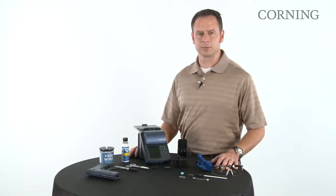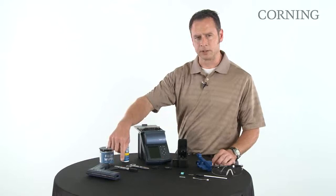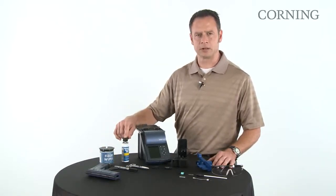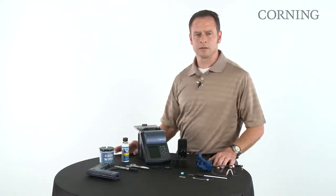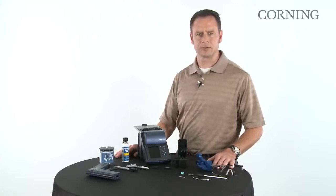The tools needed for this procedure are the cable prep tool, black marking pen, lint-free wipes, 90% or better isopropyl alcohol, and your snips for cutting aramid yarns. We also recommend that you use an industry-approved fiber ribbonizing tool, which could be of your choice.